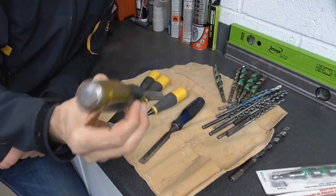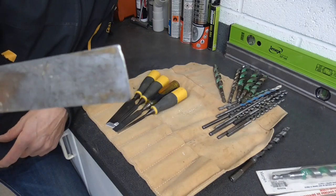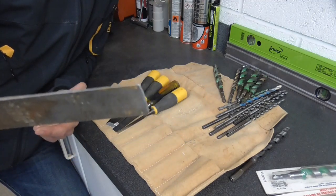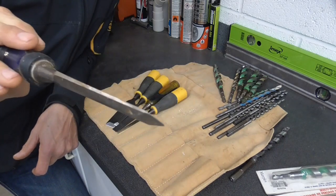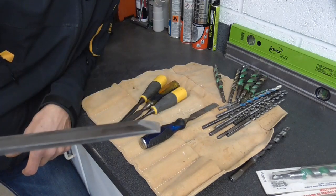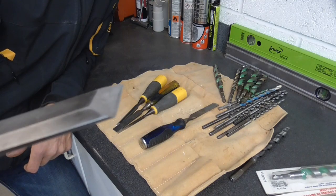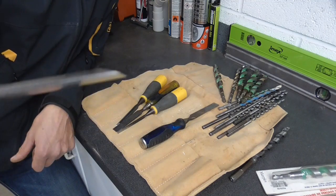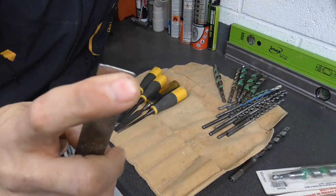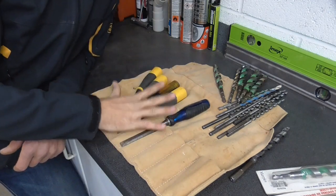The last one I've got is a three-quarter-inch chisel — this is my absolute beastie wrecking chisel. You can hammer it all the way through. I use it when you can't get something off, you've got a wedge against a steel beam or bricks, or you're chipping off blockwork. I sharpen all these with my belt sander — I get a slight grinding angle on there and then my sharpening angle is just a little bit steeper. It doesn't hold its edge quite as well but for a rough ground edge it's good enough.